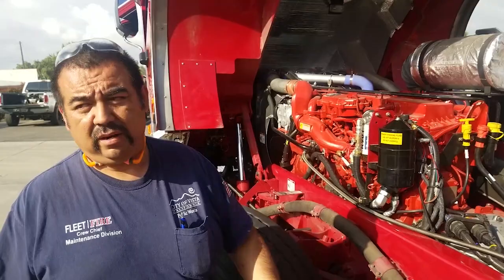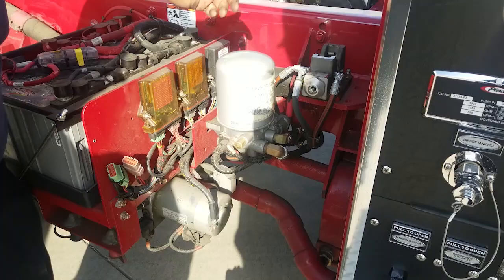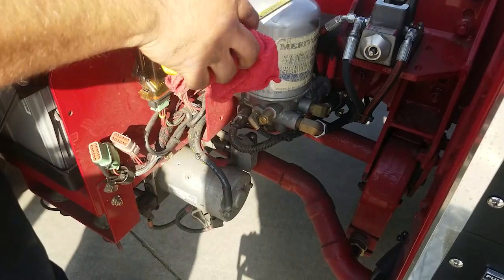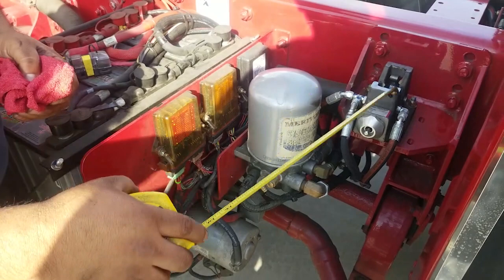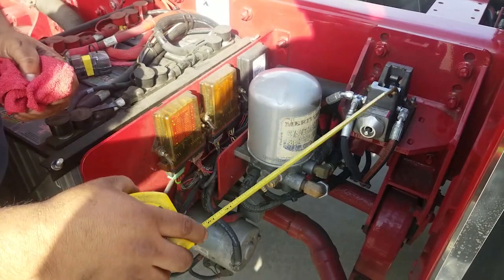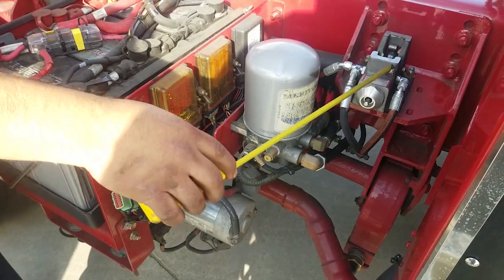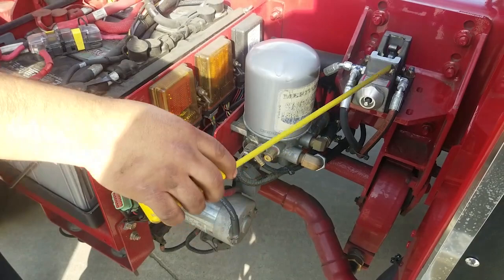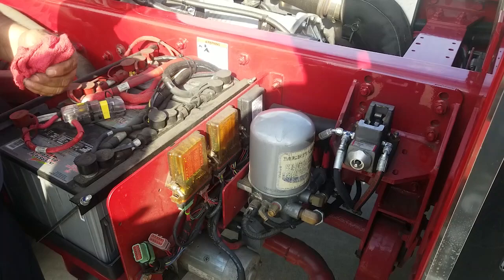This is your air dryer — make sure it's not falling off, no broken loose hoses, no leaks coming from here. You don't have to get a spray bottle; just listen for it and check it. These are your cab latches — you will get a little bit of class-one oil moisture. For the most part they stay pretty clean. Make sure you don't have any leaking coming out here, because that pressure is in direct relationship to the rams. When you hit the switch to lift the cab, it fills this up with oil to pull the locking pin out; once the locking pin bottoms out, that pressure goes to the rams and lifts the cab. Any leak in here we need to know about — we usually keep these on hand and can often change them out in the field.